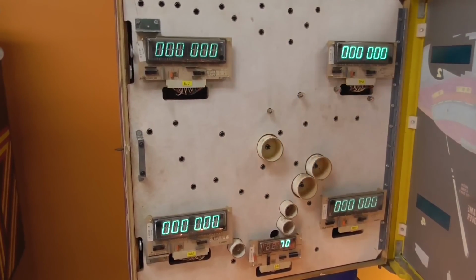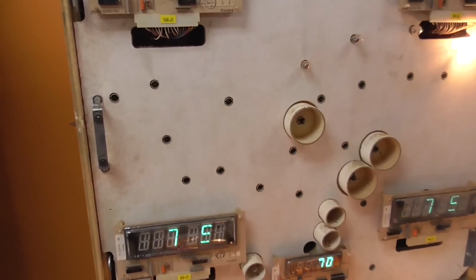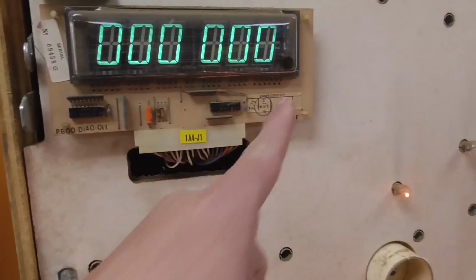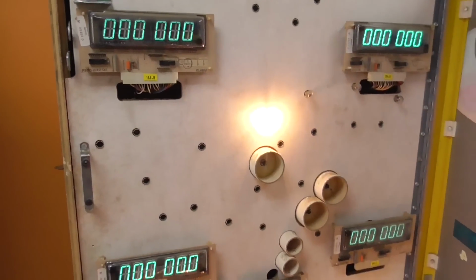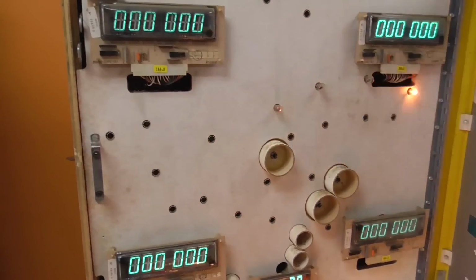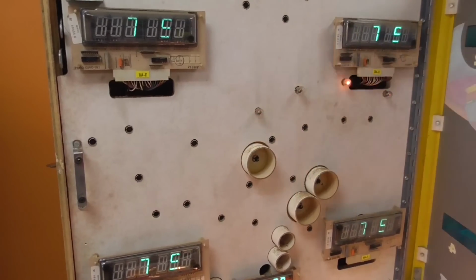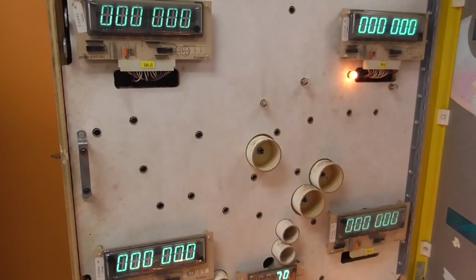It's the Todd Tucky fix. Todd knows how to fix them. There's a bunch of different ways you can do it, but basically you take voltage and put it to the two outside pins and shock the hell out of it, and it burns the little heater filaments in it and makes the display brighter. It burns the crap off the heater filaments. I'm not kidding. That's exactly what we're going to do.